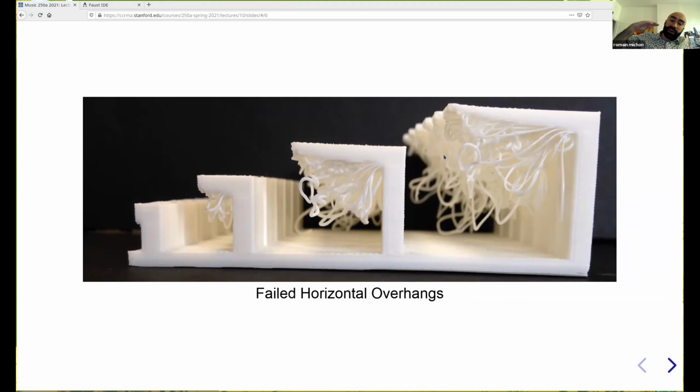3D printers that have support materials have two nozzles. So they can use two different materials. And one material can actually be dissolved in water. And the other material is the material that you're using for 3D printing your object. And so it means that the support material can be 3D printed just like the other material. And once your print is ready, you take the object, you put it into a bucket with water, and then because the support material actually dissolves in water, after an hour or something like that, the support material will be gone, and then you wash your design and you're done.